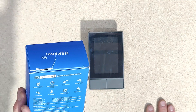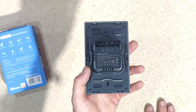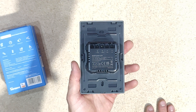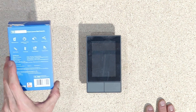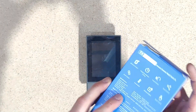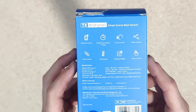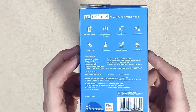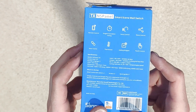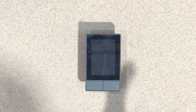It is mains 240 volt wiring, so you should be a qualified, trained electrician to install these. I've done enough of it, worked as a TA to be able to do this, even though I probably technically shouldn't. The important things I'm really interested in is that it has the built-in thermostat which can also detect humidity. It's got a built-in microphone, it's got the display, and it's got the relay. So I'm putting ESPHome on this, and you can already get all the templates for it — should be an absolute breeze.